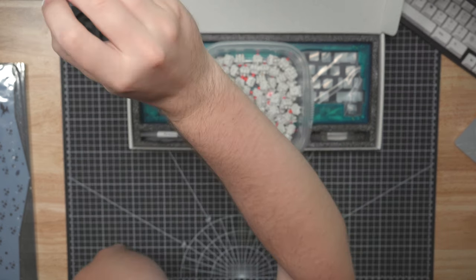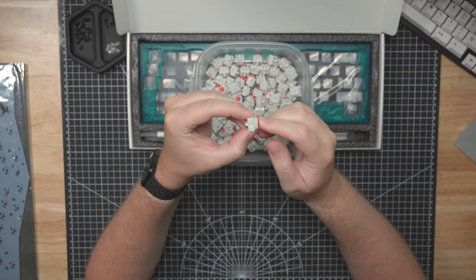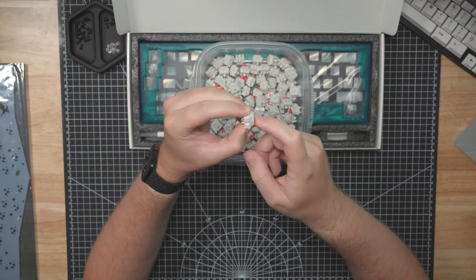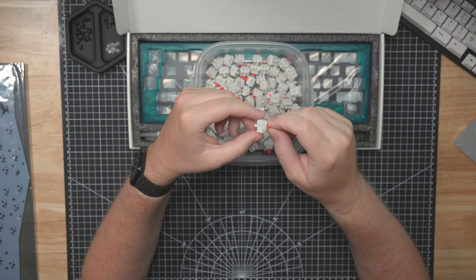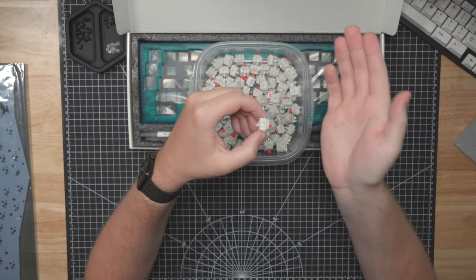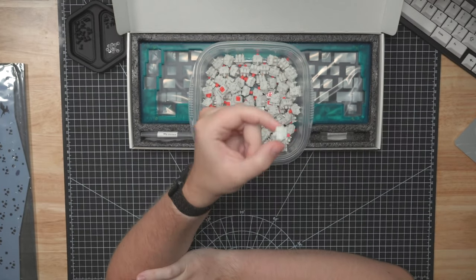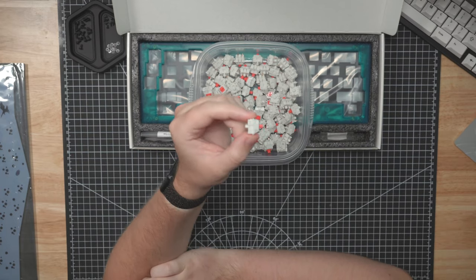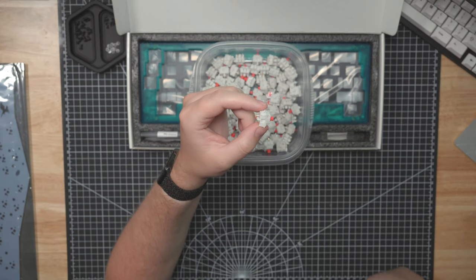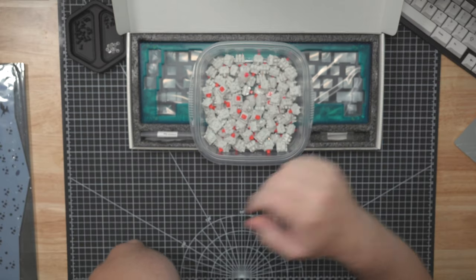They're a very snappy switch and have a hilariously short 2.8 millimeter travel. For reference, an MX style switch typically travels 4 millimeters. That's what's known as full travel. A lot of switches, especially with long pulls, will only travel like 3.5, 3.6, around there. These are 2.8. Matt and I didn't realize till after I ordered these that there's actually a document on the store page that explains roughly what your travel distance will be in different housings. We picked seriously like the shortest combo. So this is just about the most Ian and the least Matt switch in the world.